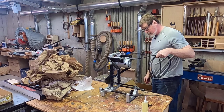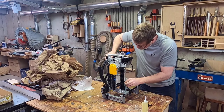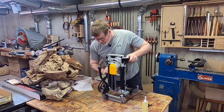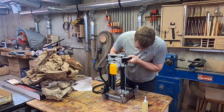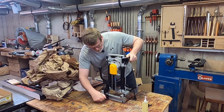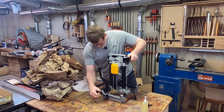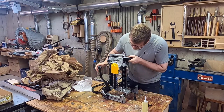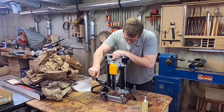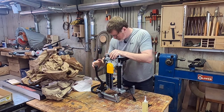There we go. This looks like what I remember - depth stops here, this locking bar to clamp it on the beam. This adjusts the position side to side of the mortiser once it's clamped on the beam. And then this, as I recall, moves it a full chain width - so you set it and you can move it one chain width with that.